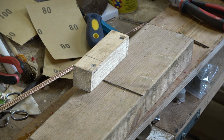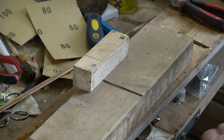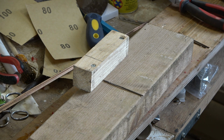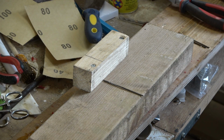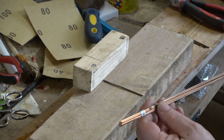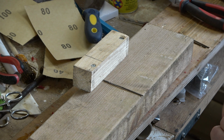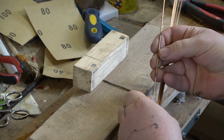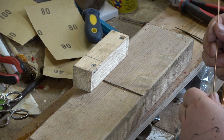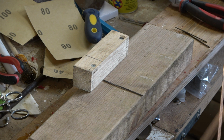So we have in stock, although I've reordered because that's the wrong one. Where did I put that? Ah, here. So we have some lengths of phosphor bronze wire here, which is 16 SWG, standard wire gauge. And that is exactly, I checked it with a micrometer, and it's exactly the same. The phosphor bronze, so self-lubricating, doesn't rust. Let's pull one of these lengths off.